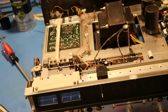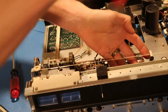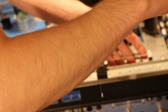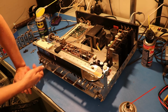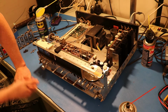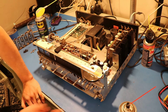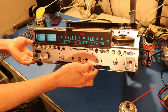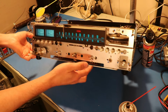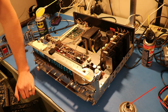And we'll grab another used one, throw it in. Okay, so there's that. Put it right back in. All right, and we're gonna barely tighten that screw we loosened because, again, brittle plastic. I know I said we're gonna wait to turn this on, but I'm curious. Let's plug this back into the dim bulb and run it that way and see if anything happens here. Still have very dim bulb, and as you can see, everything's lit up now. Fantastic. And it looks OEM because we used an OEM bulb next to other OEM bulbs.